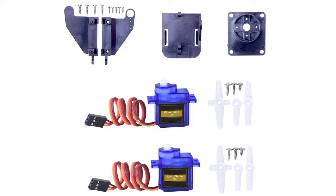Next we have a mechanical pan-tilt assembly featuring two microservos. These microservos can be controlled using pulse timing from just about any sort of microprocessor or microcontroller. The Arduino environment has a servo library that can be used to position the microservos to pan and tilt the pan-tilt assembly.